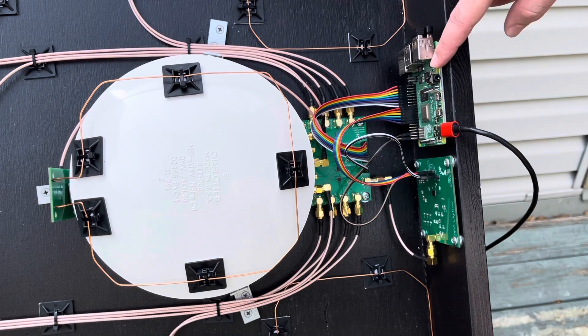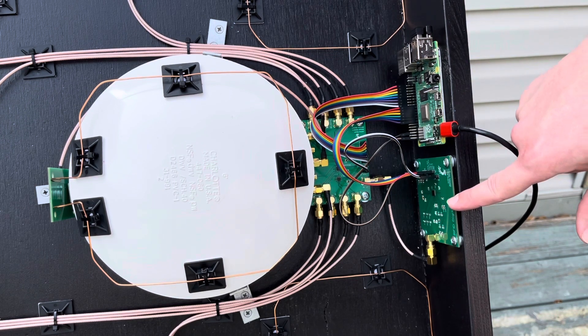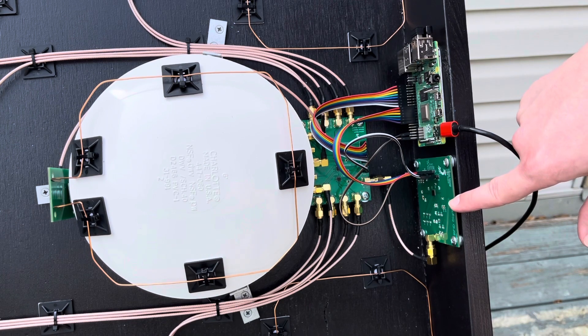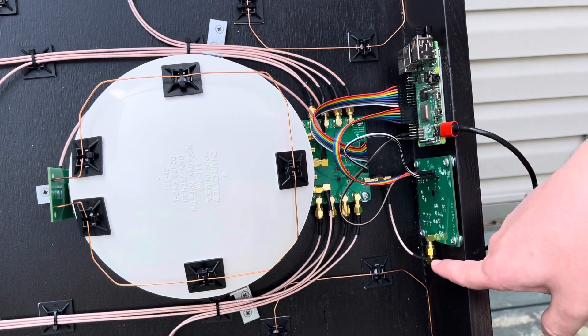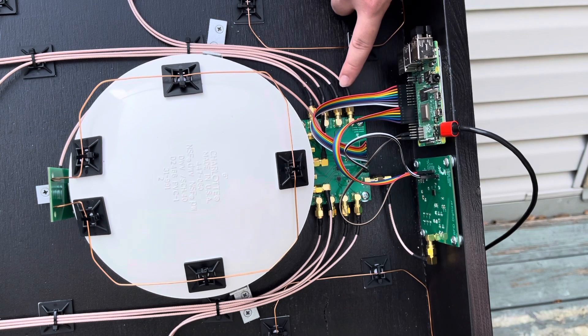Taking a closer look, our Raspberry Pi is going to act as our main controller unit for this project, hosting the firmware and the web app. That firmware is going to use the SPI protocol to send a command to our RFID reader board. The RFID reader board then generates the correct RF signal to pull the unique ID from the RFID tags embedded inside our cornhole bags. That RF signal travels through custom coax cable to our RFID switching board. We also utilize the GPIO on the Raspberry Pi to control the select pins of the switches on our RFID switching board, and from there the RF signal travels through custom coax cable out to all of the antennas.